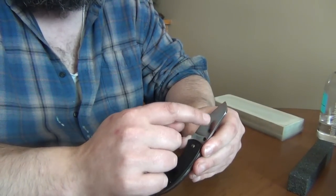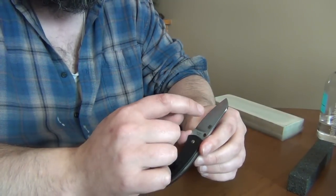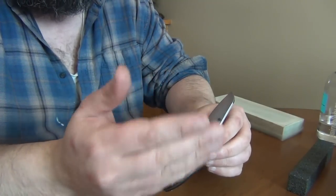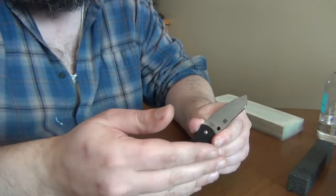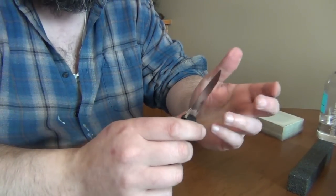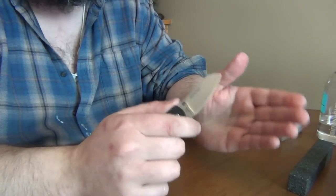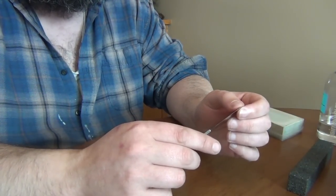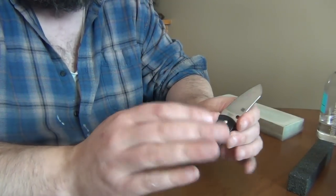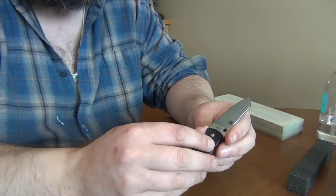The main blade bevel, almost nobody maintains. The only reason you need to do any work on the blade bevel is because when you grind the edge bevel, it gets thicker every time. And at some point, it will affect the cutting ability and ease of sharpening. But very few people use their knives that extensively. Murray Carter talks about it a lot and maintains that you should always work the blade bevel. But again, you have to use your knives an awful lot for that to become a factor. If you are grinding down the main bevel, you need to use an ultra aggressive stone, like a 100 grit stone, and you need to put a lot of force to get stones to cut because the contact area is so wide, the pressure becomes very low.